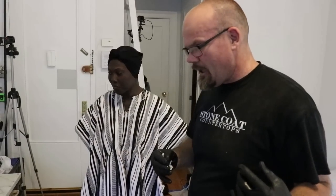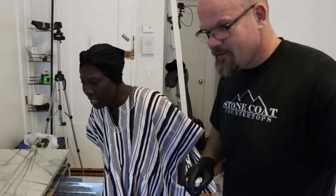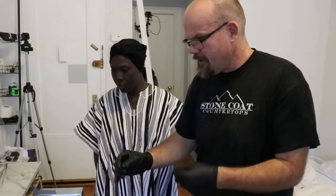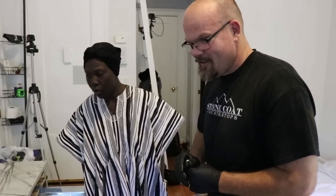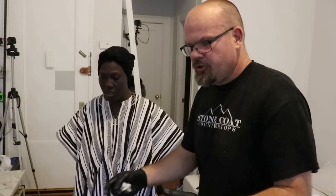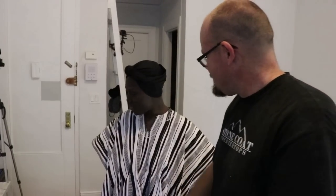A heat gun is a great choice to move color to make it look much more natural. Natasha, this is our first go at it — we've got all kinds of different striations going. What do you think? It's quite incredible to see how little color you actually need. I don't think I want it to be as busy — if I keep adding more every time we bisect, I don't want to do too busy. This to me is my interpretation of that marble. This came out fantastic. You could see the depth because of that first layer, and then some of the lines are really wide and fanned, and then you get the more sharp ones. Our final step of today is to simply torch the top to get the excess bubbles out, and we'll be ready for our clear coat tomorrow.